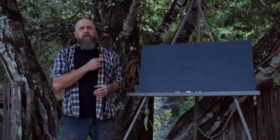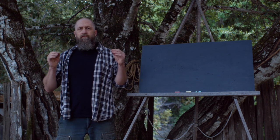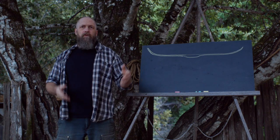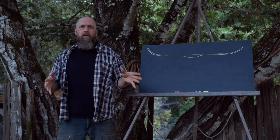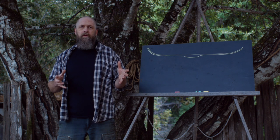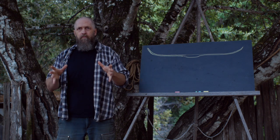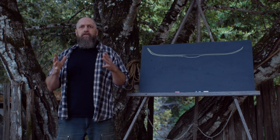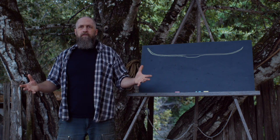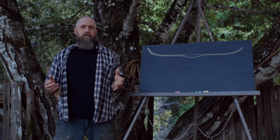Let's move to the chalkboard a little bit to look at bows. Bows are an excellent model of wood under extreme stress, often operating right near the edge of failure. In order for a bow to do its work without failing it has to be very resilient to stress. Strength is kind of a sloppy concept because it depends on what kind of stresses are applied. Resilience is the right word for the total resistance to the stresses a bow undergoes. I've discussed the importance of resilience in axe handles in another video — there'll be a clickable link at the end.